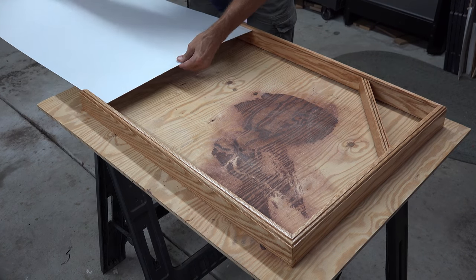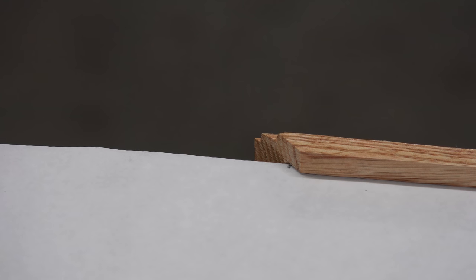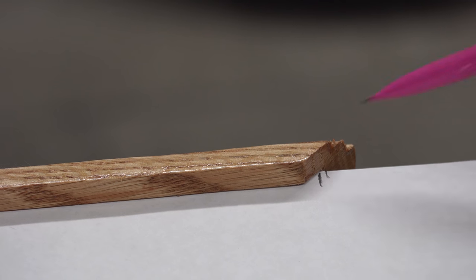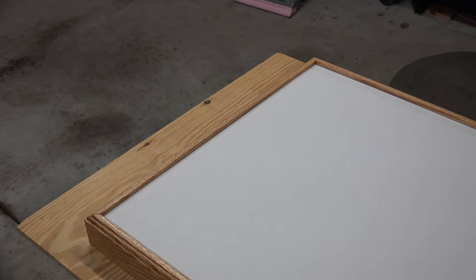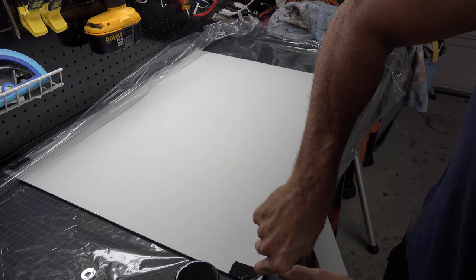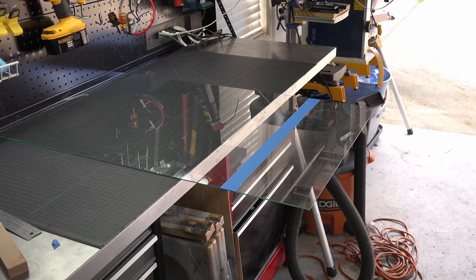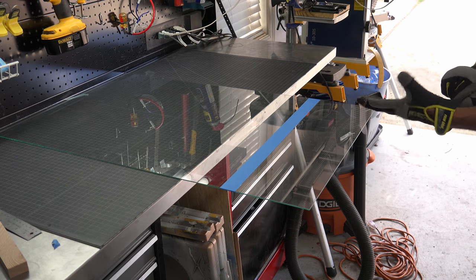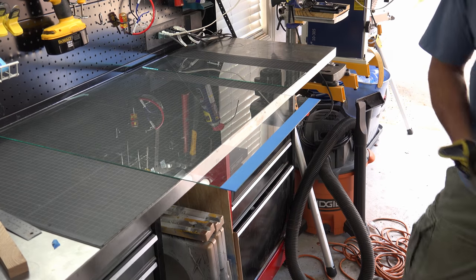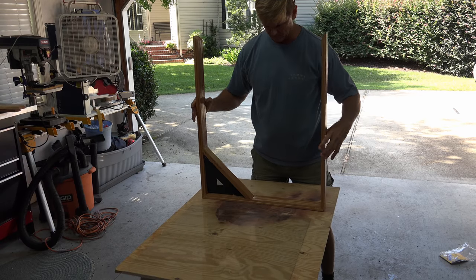Go ahead and check your fit with the entire box. Now that the width of your template is perfect, let's cut the length of the template. After your cardboard is in place make a mark to cut the bottom of your cardboard template. After cutting, place your bottom piece of the shadow box back into position and ensure everything fits well. Using your template, mark your glass with a grease pencil and continue with your cuts. I have received a lot of feedback on my glass cutting techniques — one common error I make is striking the glass more than once. Taking advice from my viewers, I strike the glass one time and then with a piece of duct tape I tape along the line and make my break.